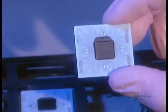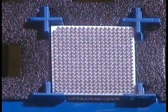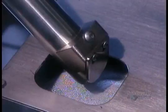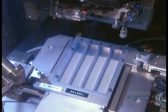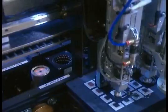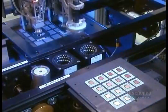The result is a microchip with a thousand connections. For even more connections, they use tin balls instead of columns, because balls are sturdier and more reliable. They too go through a suctioning sieve, but instead of paste, they're stuck on with flux — that sticky chemical used earlier to position the microchip onto the substrate.